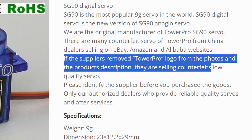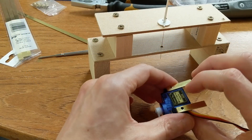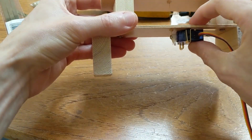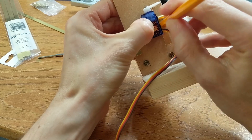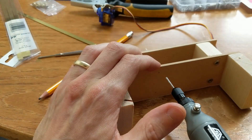Developing a product takes an investment, as does manufacturing it to be compliant with various regulations that are there to keep us all safe. To mount the servos under the railway's door I made some brackets by bending 0.8mm thick brass strips that I already had — it was quicker and cheaper than ordering some servo brackets from eBay. I want the option to make fine positioning adjustments, so if needed I can mill the screw holes to an oval shape to let them slide back and forth before tightening the screw.